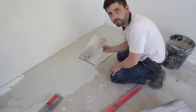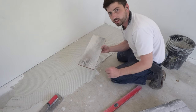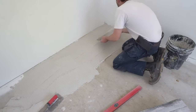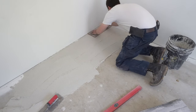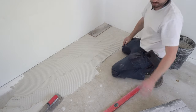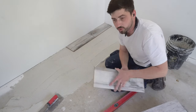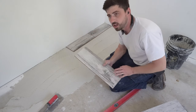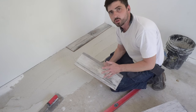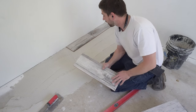Let's put down the first tile. Make sure you don't put it up against the wall too tight — you want a little bit of movement because no wall is straight, they're all a little wavy or bowed. I usually do it about a quarter inch from the wall, unless you have some tiny base then you'll have to make your decision. And another thing — I'm doing this without any spacers. I love small joints; we don't use anything bigger than an eighth in our company, so I'm going tight on this one. It's going to be perfect and beautiful.